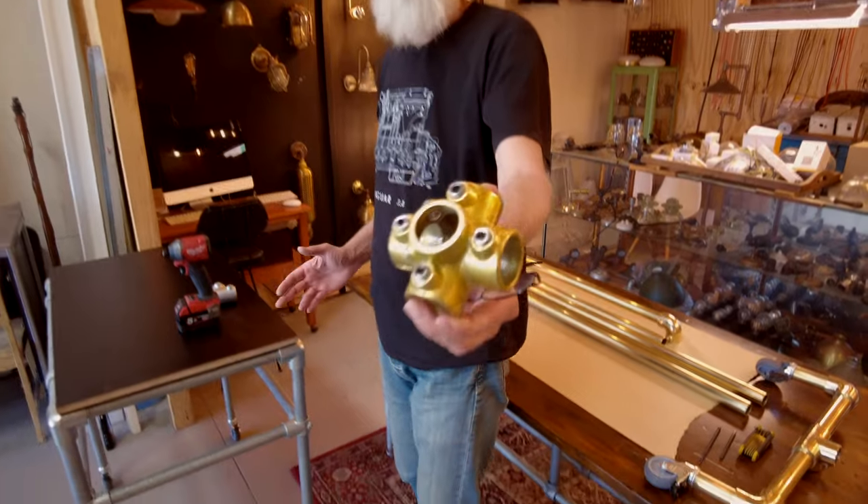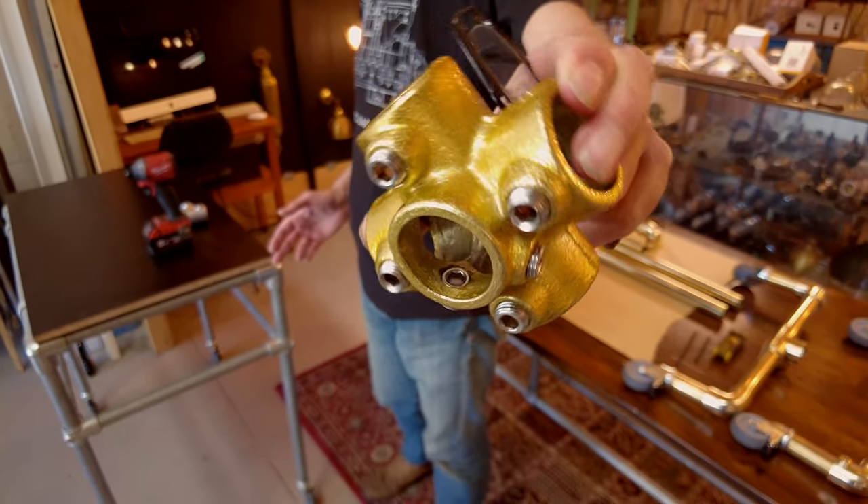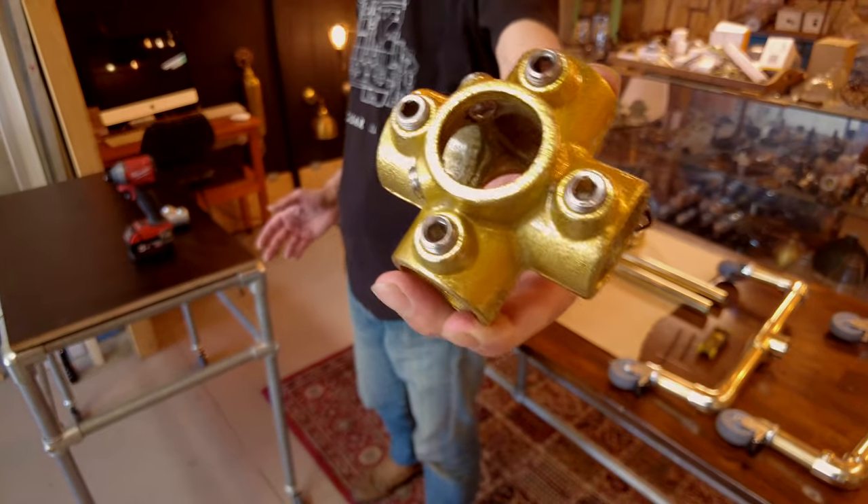We started, made a few, had a bit of a test, and then somebody asked: can we make them in brass? We thought yes — we can get the pipe material in brass, but for the compression fittings we'd have to cover them in a powder coat to colour them brass. So we would polish the galvanised and then powder coat in a clear or transparent finish.